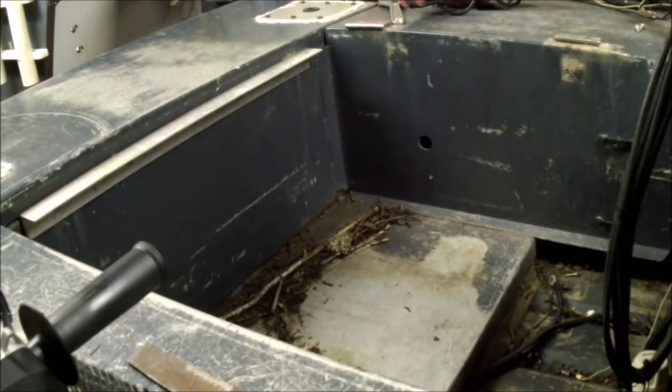The first project for this boat rebuild is the bilge area. As you can see by this piece of aluminum angle and these two stainless steel hinges, somebody had a sheet of plywood across here at some point. I've got a quarter-inch aluminum sheet that I'm going to use to fabricate a new cover. These sides on either side of the bilge — I thought they were foam-filled for flotation, but when I looked in there, they're empty and hollow. So I'm going to be cutting access holes in either side of the bilge to store my six-gallon fuel tanks.